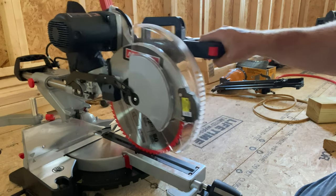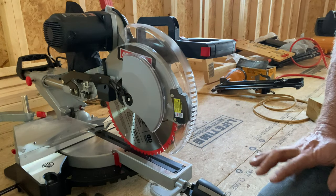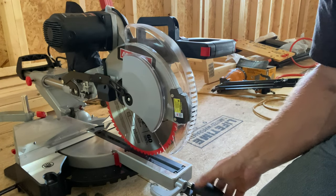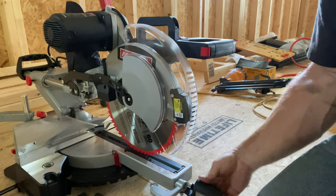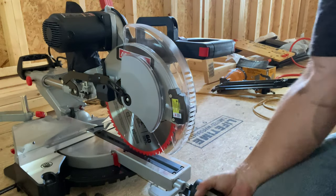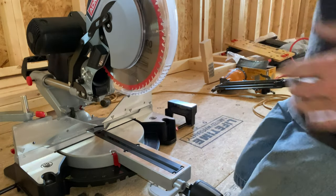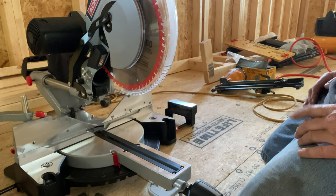Assembly has been done. There are a couple of things I'll say — I was pretty pleased with just about everything. The mechanism to get the blade on was a little cumbersome; I'd like to have somewhere for the wrench to go to put the blade on. The miter gauge lock is a little inconvenient — you screw it in to lock it into place, unscrew it, then swing it around to your desired spot, and lock it in if you feel like it. It has stops at 22.5, 45, and 90 degrees. Other things about it I really like — all the mechanisms and safety features. It assembled really pretty easily. There's really not a whole lot else to do but make some cuts.